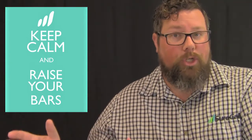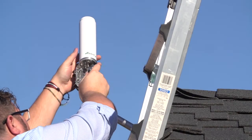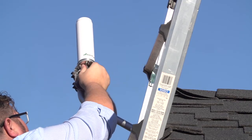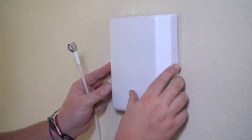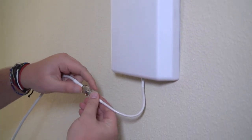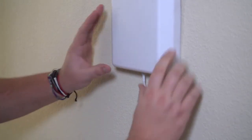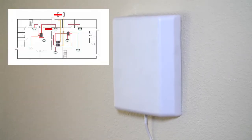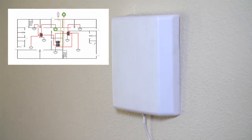Let's talk about what those manual gain controls do and how to adjust your booster. As with any signal booster, uplink and downlink are important, but so are separation and balance. You can have really great signal getting into the booster, but unless you know how to configure it properly, you could be sacrificing coverage and overall performance. There are boosters that have automatic attenuation, which makes installation relatively simple, but they do not provide configurability. Click the link to our video about attenuation for more on that.